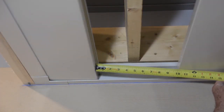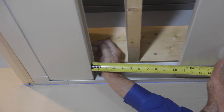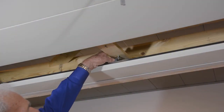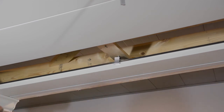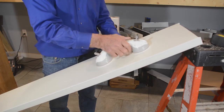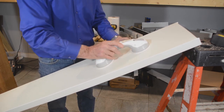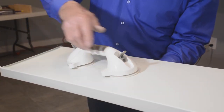Once the gutter end of the modified panel is in position, lock it onto the gutter. Check and adjust your measurements. When the opening is correct, put the long panel latch in place. Attach a suction cup to either or both ends of the panel. These we show are available in the bathroom section of hardware stores as safety assist bars.